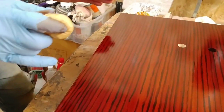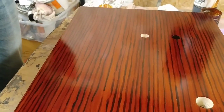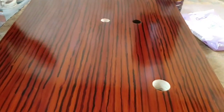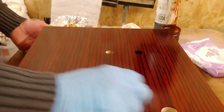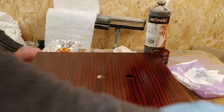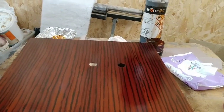Another way is to build up loads of thick layers of polish, leave it a few days, then flatten it right back to fill the grain with polish — but it takes ages that way. With this plinth there is no real grain; it's a fairly flat piece of ply. I'm not entirely sure what the wood is on top — might be birch but the grain doesn't look like birch to me. Anyway, I'm going to keep going, leave it tonight, then come back tomorrow evening to do more and hopefully do the final buff up.